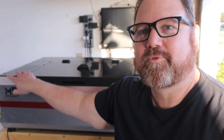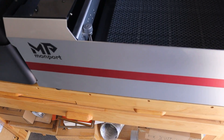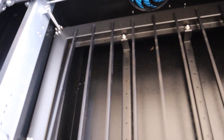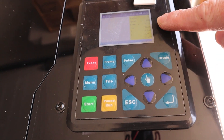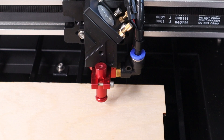The 45-Watt Reno is a desktop CO2 laser that features a 45-Watt laser tube, a 16 by 12-inch work area, an included option between the honeycomb and knife edge bed, a Ruida controller — which is something I have not actively used before but ended up really liking — a megapixel camera, a magnetic focus assist, and some other things that I'll happily show you.